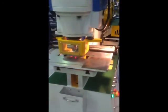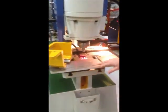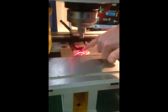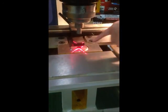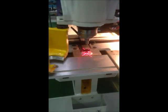Just moving back up here to the punching station. You can see it's got a stripper plate and guard which flips out of the way. Now we can see our top punch and our bottom punch. This particular model has also got laser lighting as well, so you can set your material up so it's dead centre every time you punch.